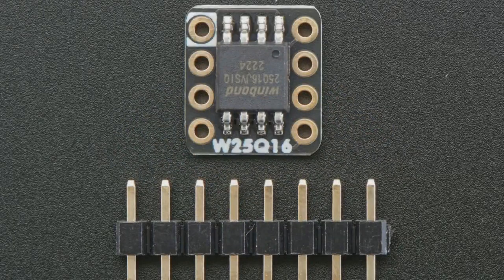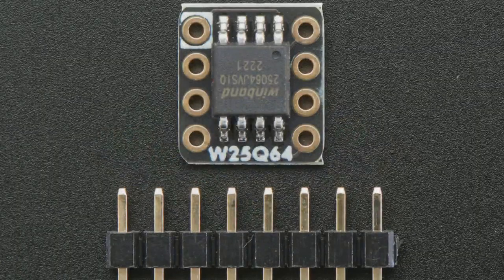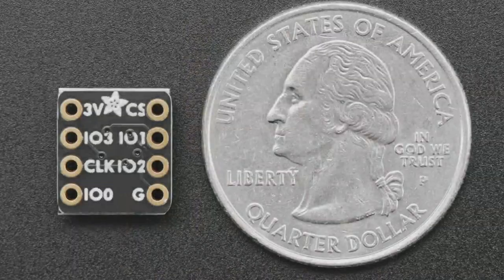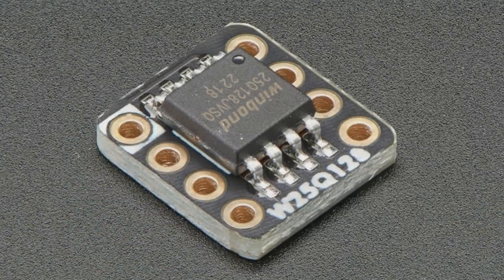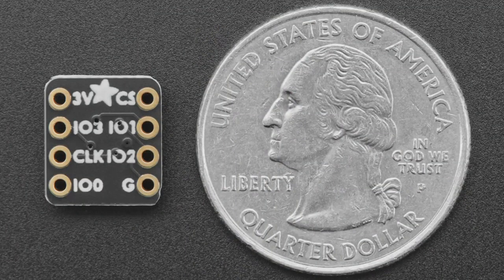It's really meant for QSPI only, although you can use it in plain SPI mode. It's also only 3 volt. It's a basic little breakout, but for a couple bucks — I was just tired of soldering these to breakout boards. For people who want to use these in Circuit Python, embedded Linux, MicroPython, or our Arduino SPI flash library, you can use them as mass storage. They're inexpensive — if you don't need a full SD card and just need 2 to 16 megabytes, these work really well. They're now DIP-like, aligned to 0.3-inch width with 0.1-inch spacing, so they fit in a breadboard or a DIP socket. Headers are included.